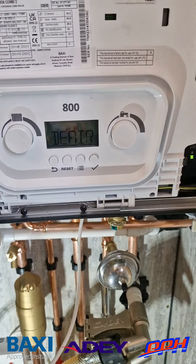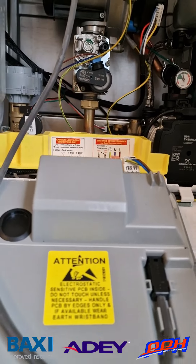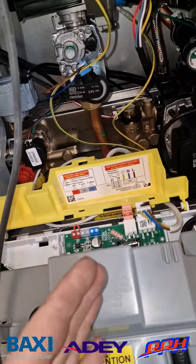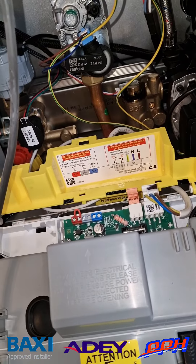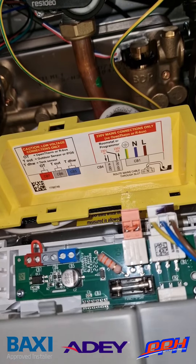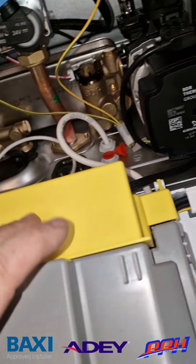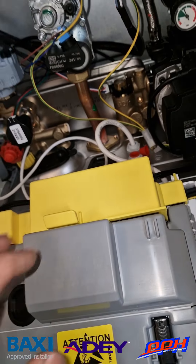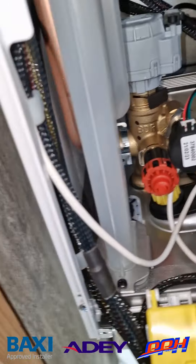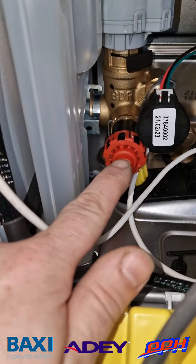Let's have a look around inside the boiler. Close and personal — we've already shown you the very handy colour-coded circuit board connections with a handy label across the back. The first thing we want to look at is our combined PRV pressure relief valve. Normally you'll see a twistable knob or lever on PRVs, but on this one you can't play with it.